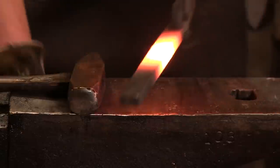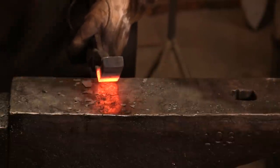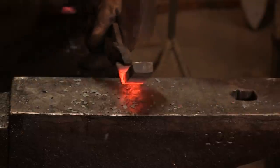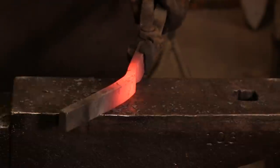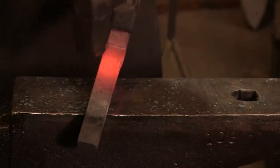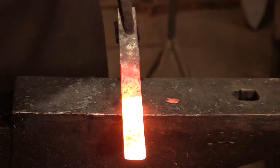I'm going to do a little bit of a trick here. I can see my mark. I'm going to lay it across the anvil and tilt this guy up — that's how I'm going to get my first incision to actually start spreading everything out. That's what delineates it. I'm going to pull this down all the way to about half the thickness, which should be around a quarter of an inch. Then I'll take another heat and do the same thing on the other side, get that out of the way, and start working in the middle.